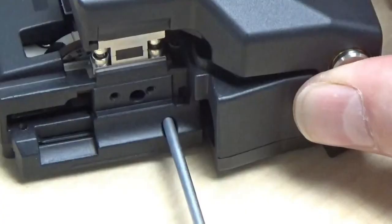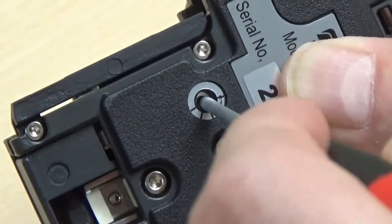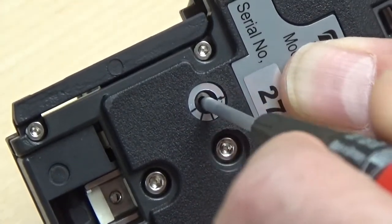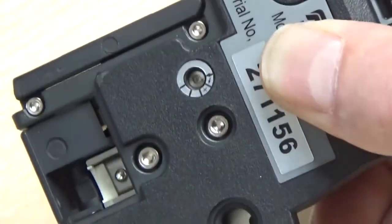To adjust the height of your blade, loosen the height adjuster screw located here by making one quarter to one half turn. Next, unscrew the height adjuster screw counterclockwise to put it back into its initial marker position here.